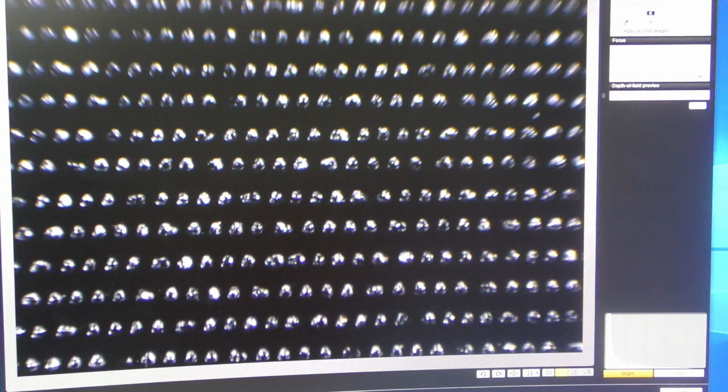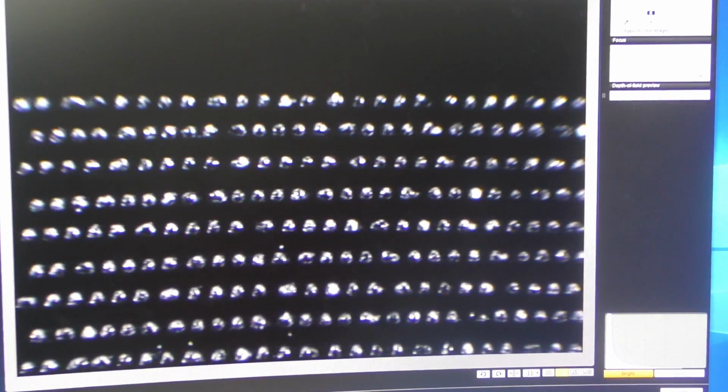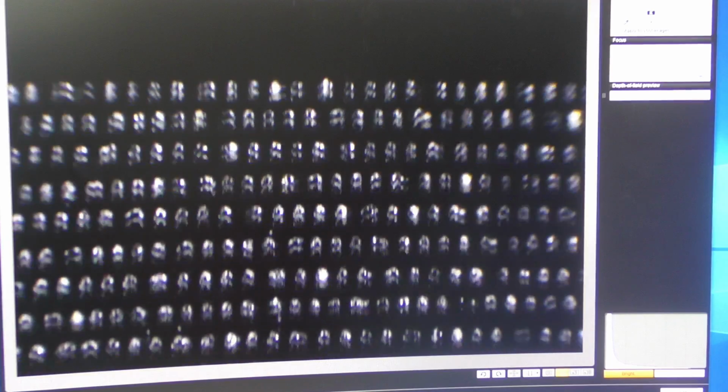So it would indicate that we're getting this 20 microsecond type of effect that I just showed you. It could be anything between 1 microsecond and 100 microseconds, which is the pulse width. That would jump straight to 9 kilohertz. They don't look significantly different, those dots. And let's take a look at the patterns that we've got in there. Well, there's one or two that might be classed as low power or missing, but there's no significant pattern in there at 9 kilohertz. That is really weird.